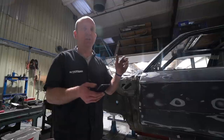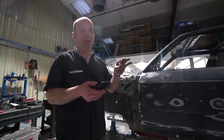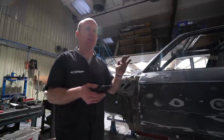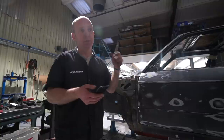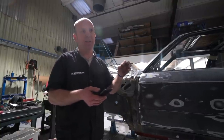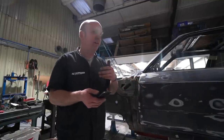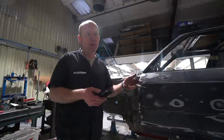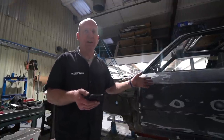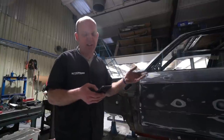South Knee asked about welding rod diameter from the welding demonstration. Generally, try to use a similar thickness of welding rod to the thickness of steel you're welding. I was using a 1.2mm welding rod for 1.2mm thick, 18-gauge steel. A 1mm rod would be fine, 0.8mm would be okay to push, and 1.6mm would be okay to push, but I probably wouldn't go outside those limits. Using the same diameter as material thickness is generally what you'd aim for.